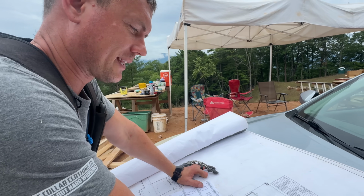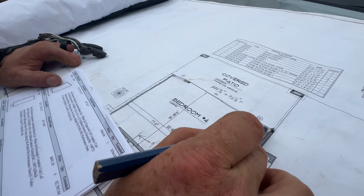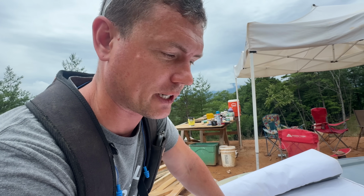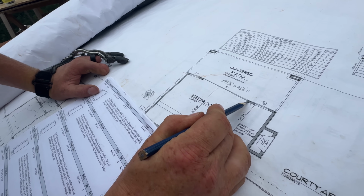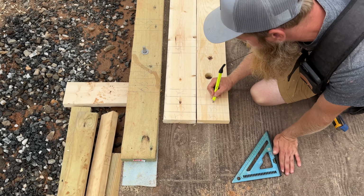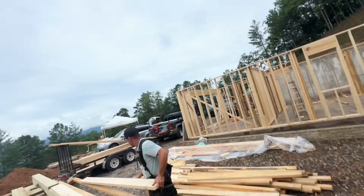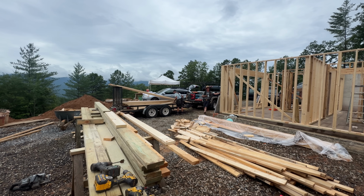This wall has an opening that is 12 feet wide for the door, and the overall length of this wall is 24 feet. Now, instead of trying to build it in one piece and having joints in the top plates and it'd be difficult to lift with a giant header in it, we're gonna break it up into 2 pieces. We're gonna build this segment and have our jack right here on the side, and we're gonna do the same on the other side, and then we can just lift the header and set it into place. We may need to check if double jack is enough, like a 3-inch bearing on the end for a 12-foot opening. It's not really load bearing, it's not as load bearing as it may appear.